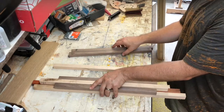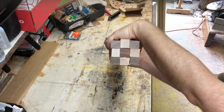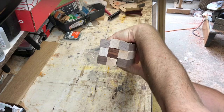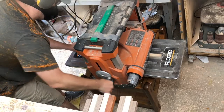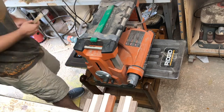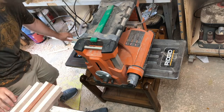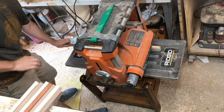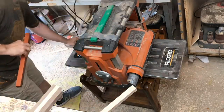Here I'm just trying to lay out where the pieces are gonna go, and here you can see how the stock's gonna look once it's all done. Here I'm just milling it up — all I'm gonna do is the top and the bottom because I don't want to lose width, since I'll need to mill it up once I glue the sets of three together.